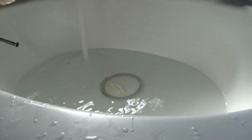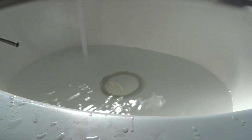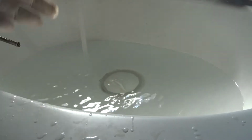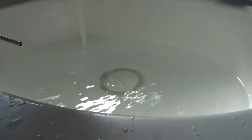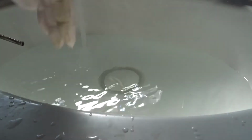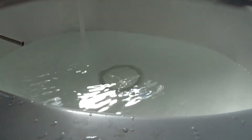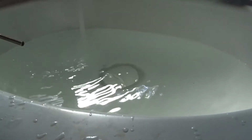And if you ever get a clogged drain like this, you want to try and use hot water, like fill up your hand basin or your kitchen sink or anything like that with hot water, because hot water actually heats all the sludge up and stuff in the pipe. If you ram something down there, even a suction cup, you could move it, but with this and hot water, it'll run around the ring of the pipe, and because it's plastic, the pipe will be hot. The actual coating of the stuff that's causing it to clog up and close in, hot water actually shifts that easier. Cold water, because it's so cold and cool, is hard to shift.